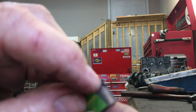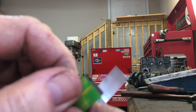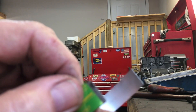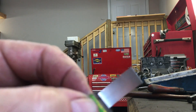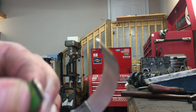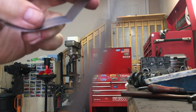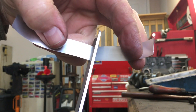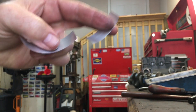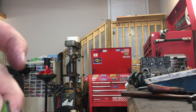You see the little lip here — this is the catch that keeps the bearing from spinning in its seat — so the shim can't cover that because it'll interfere with how it fits. I position the edge of the shim just below where that little scallop is, then hold it in place, fold it around to the back edge of the bearing tightly, fold it over on the edge, and that makes a crease in it. Then I just cut it at the crease and I'm left with the correct length piece of shim stock to fit behind this bearing. Then it goes on there like that and it's just the right length.